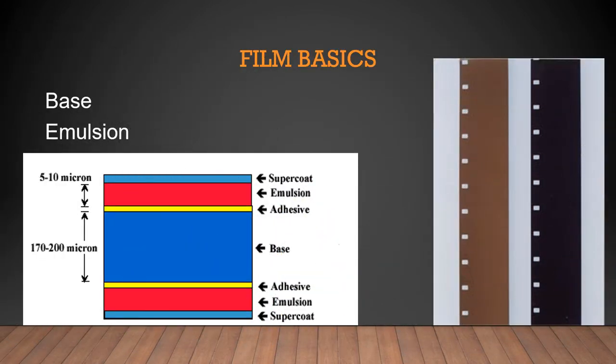When we're talking about radiographic film, it's not too different from photographic film. The image on your right is photographic film. On one side it's very shiny, on the other side it's very dull, and that will determine if we're looking at the emulsion side or the non-emulsion side. Radiographic and photographic film have two parts: a base and an emulsion.